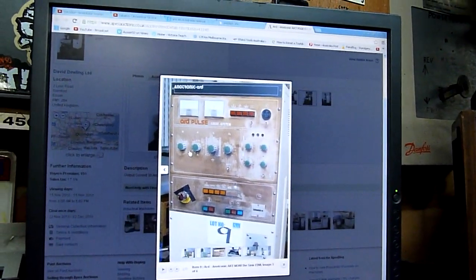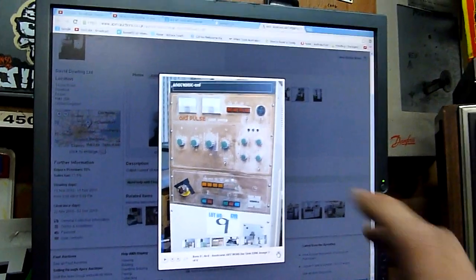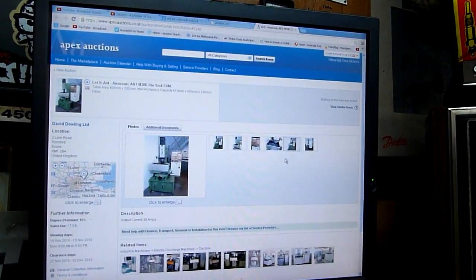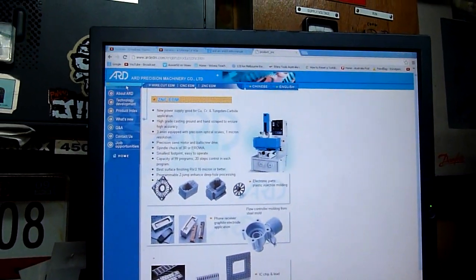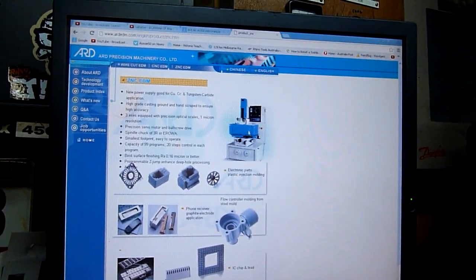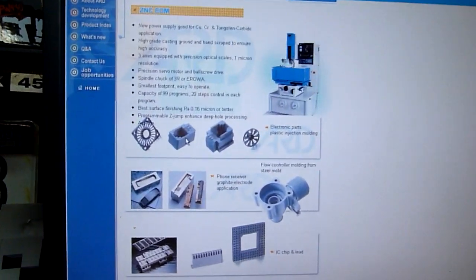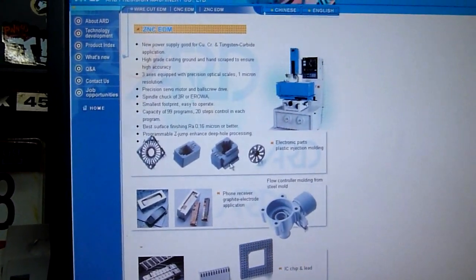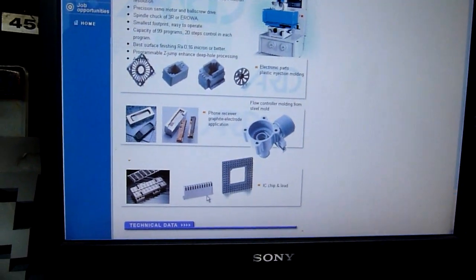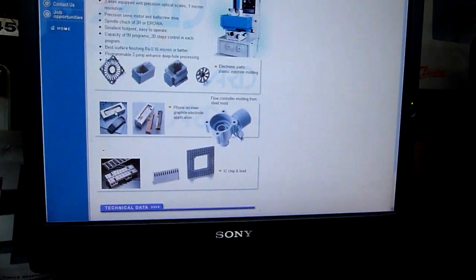I've got a rough idea of what it does; we just want to know how to fine tune it - how to twiddle its knobs and make it happy. The company ARD Precision still makes die sinkers, and I'll post a link to their modern version as well. It's showing parts made using die-sunk dies, like plastic moldings for telephone and ethernet connectors, CPU sockets, and multi-pin sockets. It doesn't make the plastic socket itself, but makes the tool - the profile in the tool - so plastic can be injected into it.